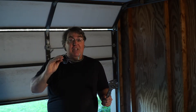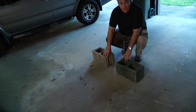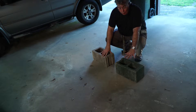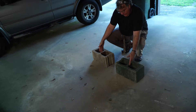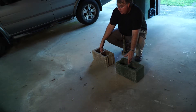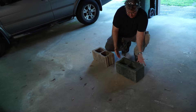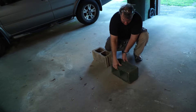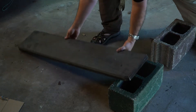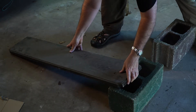I also highly recommend a good pair of safety goggles because we're going to be going under the tractor once we get it elevated. Ultimately what you want is a pair of automotive ramps — the kind you'd use to change your oil. What I have here is a couple of cinder blocks lined up so the middle part aligns with the middle of the tractor tires. I've made the holes vertical because there's more strength in the cinder block that way. Go ahead and lay your wood ramps in place and you're ready to back the tractor up onto it.